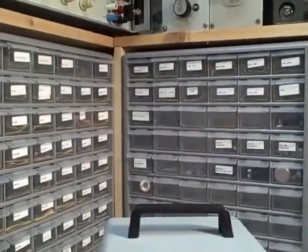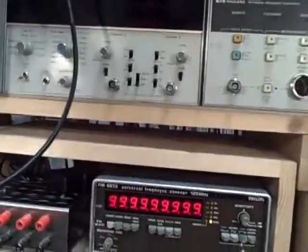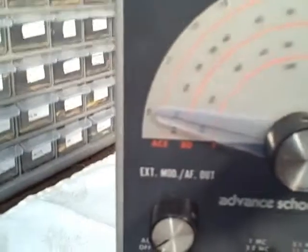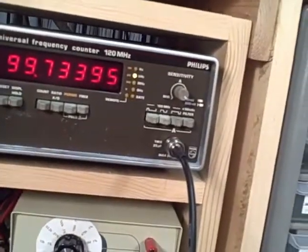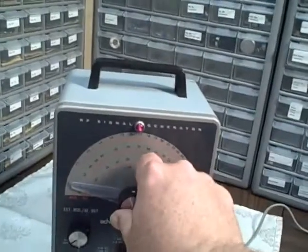Okay, we're connected up. We're on Band A right at the moment — that would be the 100 kilocycle mark — and we have a waveform up there. Let's turn on our counter. I've got the dial set right on 100 and we are reading 99.7, so three-tenths of a kilohertz off.